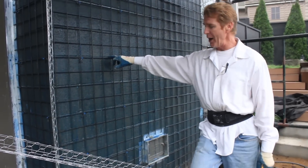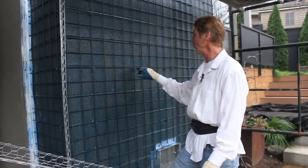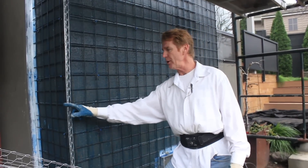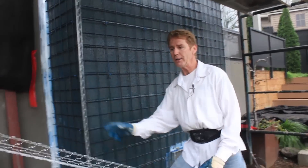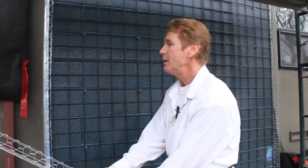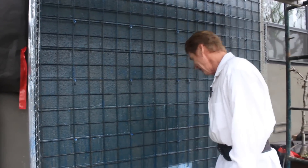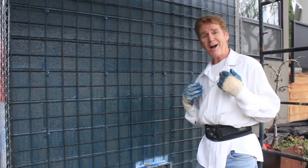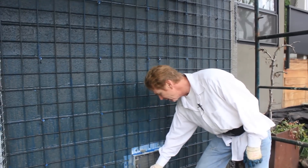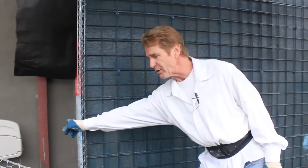They put this wire — this is generally for concrete — they screwed it into the grout, then placed the corners here at an odd angle. What they did was take a corner aid and squish it flat to come up with two inches thickness. Why two inches? For the extra strength. I personally thought an inch was fine, but their screeds are two inches on the side.